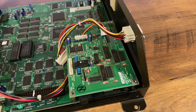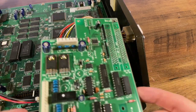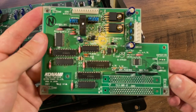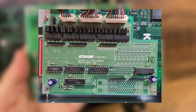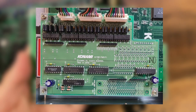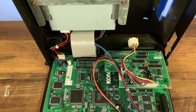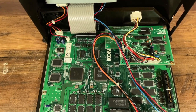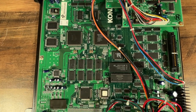Around the back is a removable panel with an extra IO connector for the reel — this is where the reel for Fisherman's Bait would connect, feeding into an internal IO expansion board visible when we open the lid. Most Bemani series games would instead use two different IO boards. One is called an analog IO board — essentially a collection of 74LS273 latches for up to 30 extra output channels, also used in Fighting Mania. Despite the name, it has no audio processing ability.